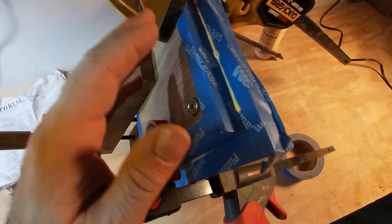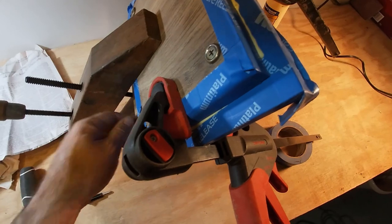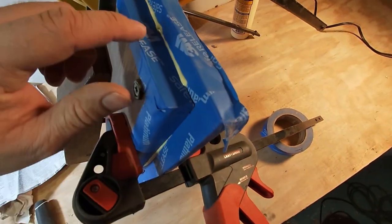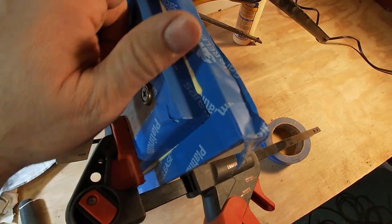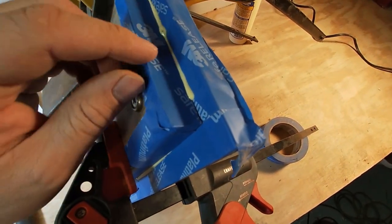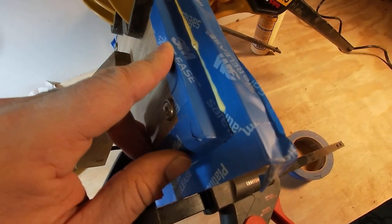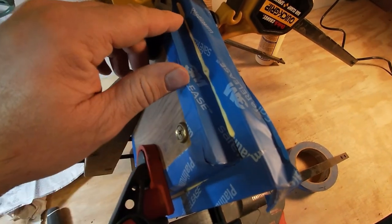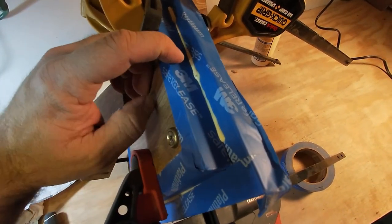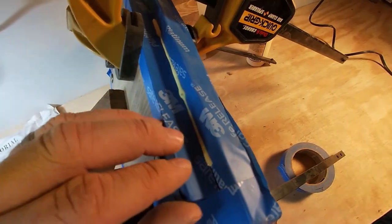What I have here is the two halves of the lid to the cooler clamped together. I've taped everywhere that I don't want bonded so that when there's squeeze out it doesn't get on the wood. It's a bit of overkill here, but it's something I've seen done — like people installing windows with black caulk — to keep it from getting on the surrounding surface when it squeezes out. Then you clean it up and pull the tape off ideally before everything dries.